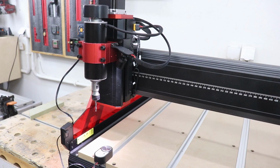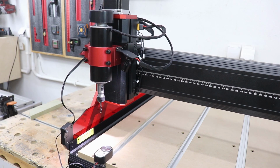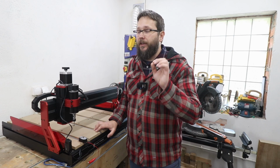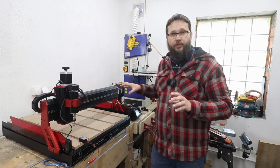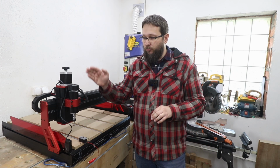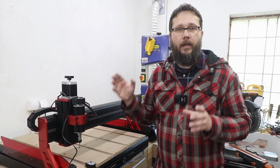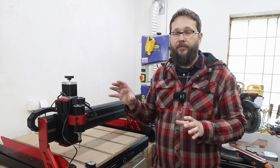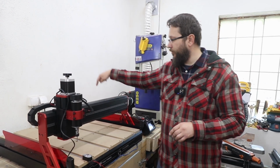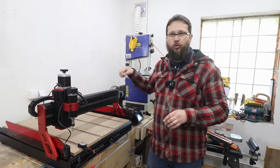So that's your X and Y axes. You can set the origin, and then you've got the Z axis up and down. And at this point, I want you to do a very important thing. With the controllers, I did show you, move the Z axis right to the bottom and right to the top until you trigger the limit switches, okay, to see if everything works correctly. Next, move your machine to every corner, okay? Take it to the maximum to all 4 corners.